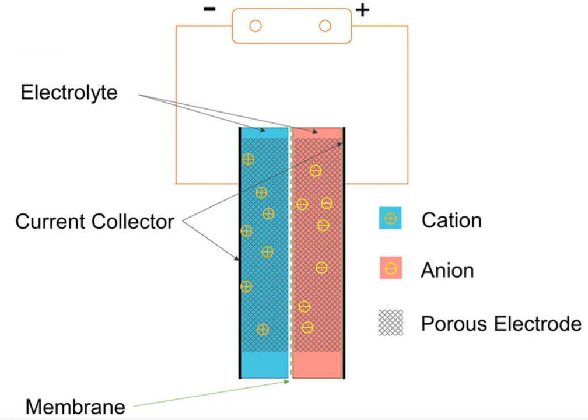of the adsorbed anions. The ability of electrodes to accomplish pseudocapacitance effects by redox reactions, intercalation or electrosorption strongly depends on the chemical affinity of electrode materials to the ions adsorbed on the electrode surface, as well as on the structure and dimension of the electrode pores.